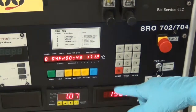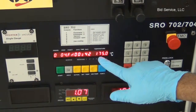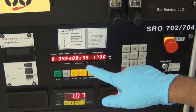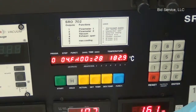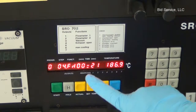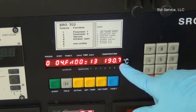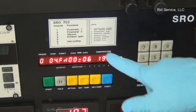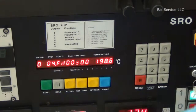The maximum rate at which the temperature can be increased or ramped up is 300 degrees per minute. In other words, you can set a time of 1 minute, and for temperature you can go up to 300 if you want to increase the heat rapidly. And once you set the time and temperature during that step, the final temperature will be the set temperature. So in this step, the initial temperature was 20 degrees, and now it's going to reach 200 in this time